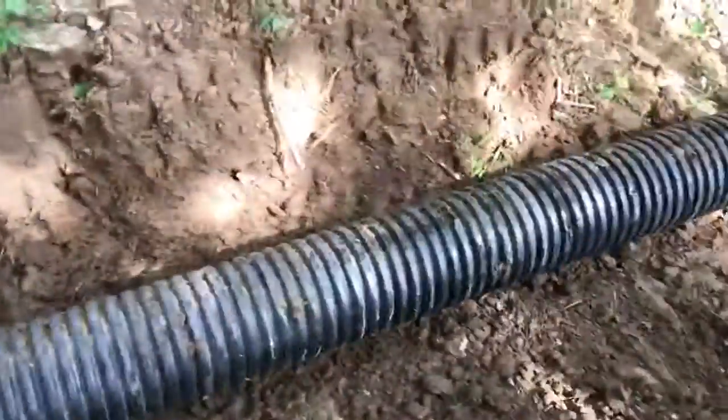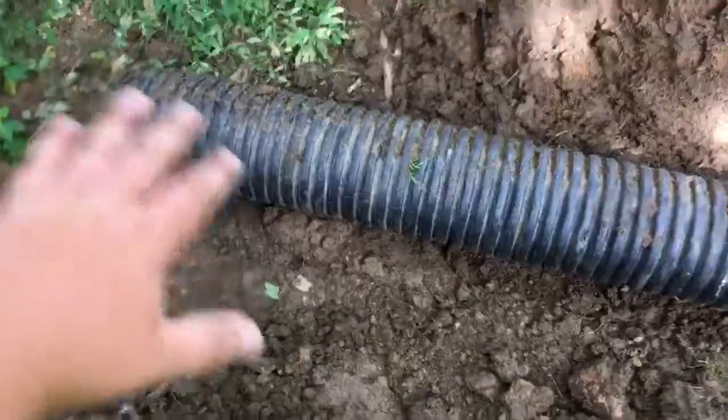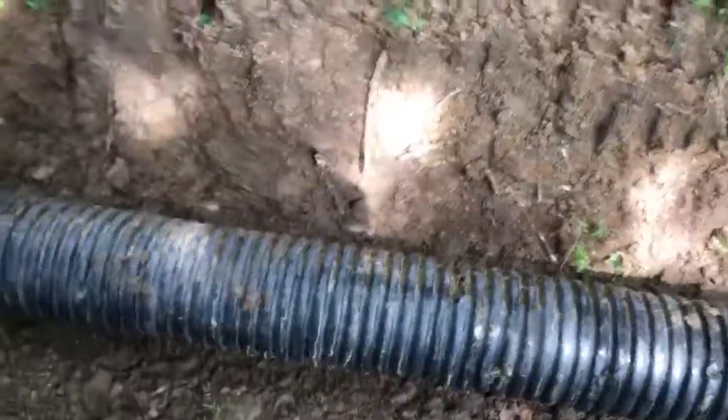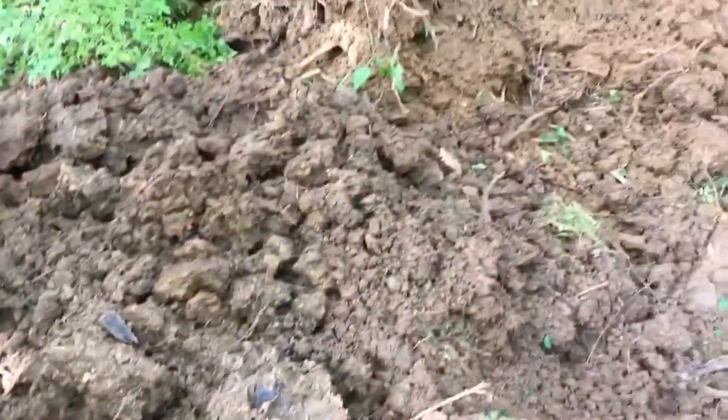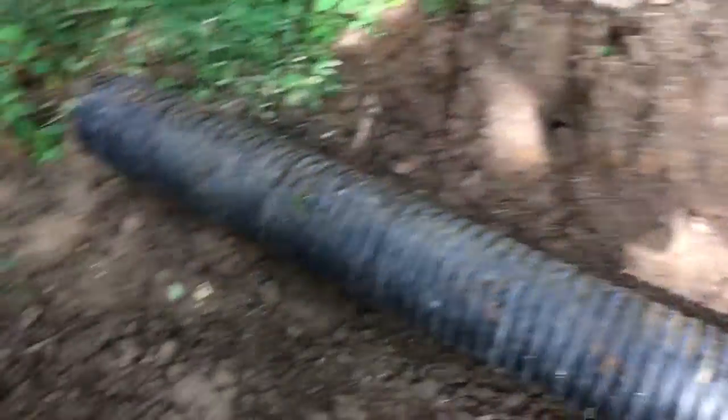I forgot to do a video earlier. I dug out this one corner to get some dirt to build my road. A little farther over I've got the culvert cut - it's gonna give me more room. I kind of built it up here, it's about that much off the bottom of the creek, but I'm gonna take the bucket and kind of push it down and smash it into the mud so it'll stay there. Then I'll start backfilling, putting dirt on this side and that side, just start packing it in real nice. I've got the excavator down here, it's just real muddy.